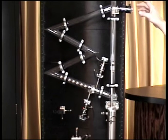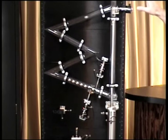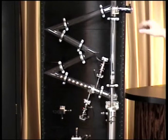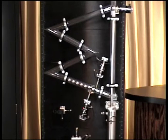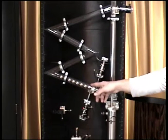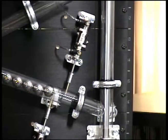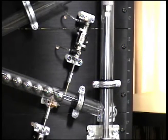That gives us a signal back to the PLC, of course, and we use that through a time delay to trigger our poppet valve, and the poppet valve controls that little single action spring return cylinder at the top that pops the ball out. The ball travels down through a couple twists and turns and it lines up with some other ones. There's also an escape, and I alluded to the fact that a lot of the material handling stuff I had done in the past, we had various escapements to sequence the product one at a time.